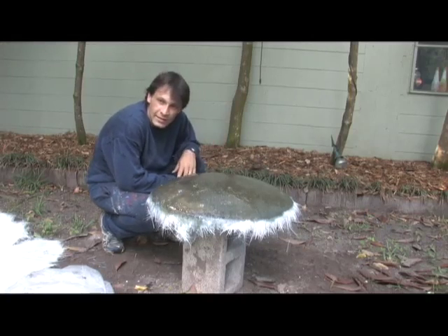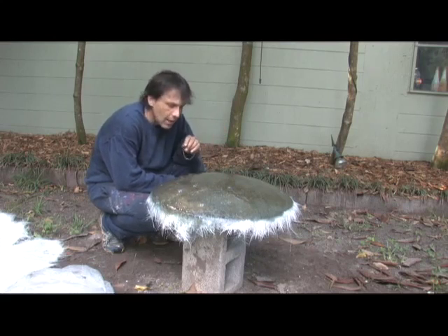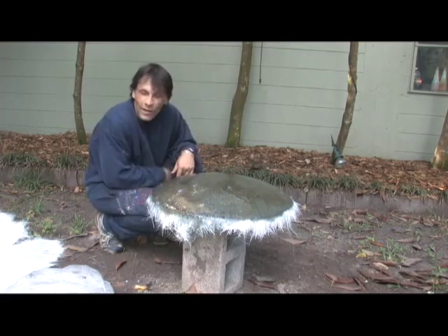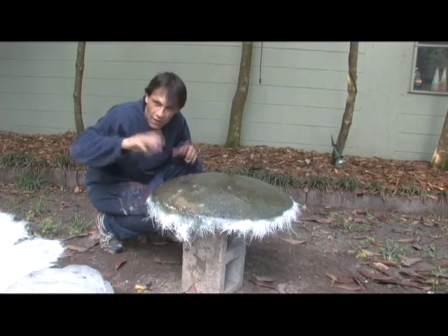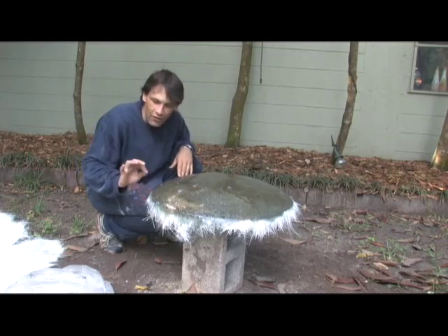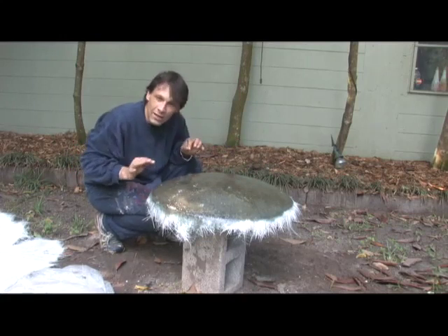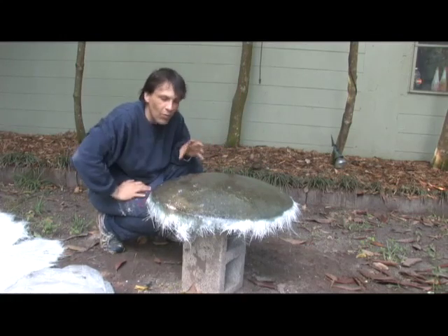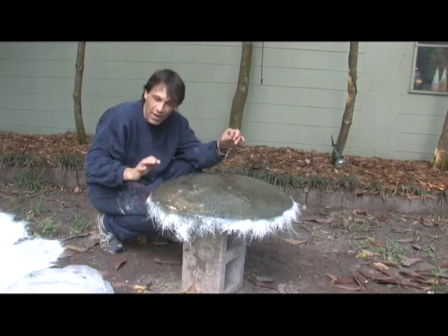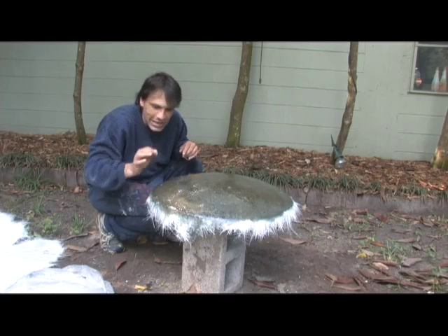This is pretty much done. This is going to have to cure for probably 12 to 24 hours depending on how much hardener you use. All resins are a little bit different. When this hardens, we let it overlap around the edges — we're going to take a table saw and cut that off to get a nice circle. If you don't have a table saw, go as close to the edge as you can and build the edges up thick because that's going to be the weakest point. The center will naturally have a little more resin. Make sure you get as few air bubbles as you can under there — it's pretty easy; you just dab them out with the brush. Once this starts to harden, let it completely harden before you pull it off.